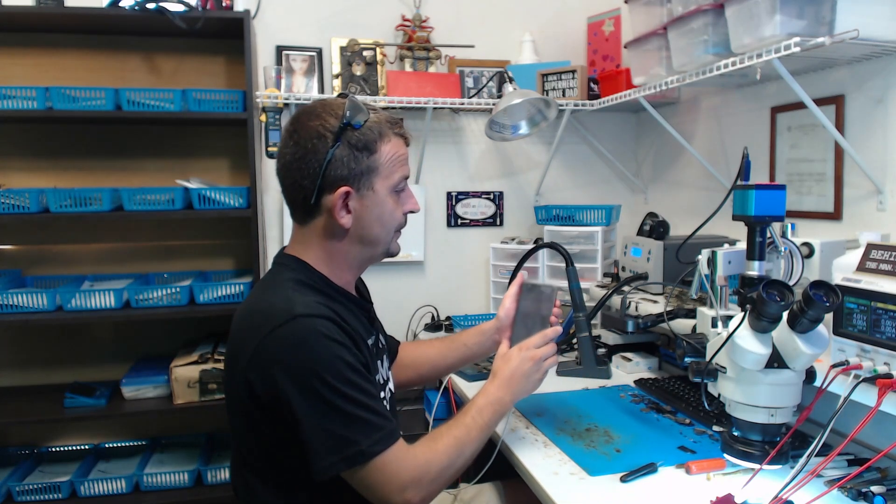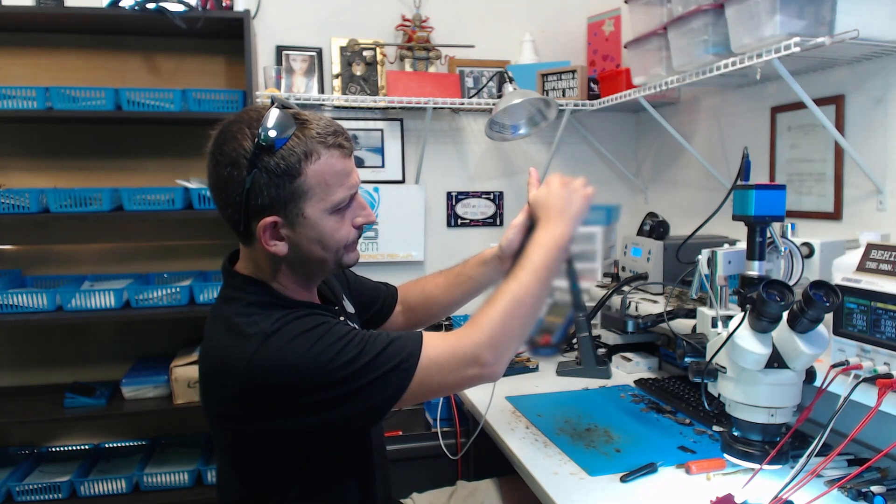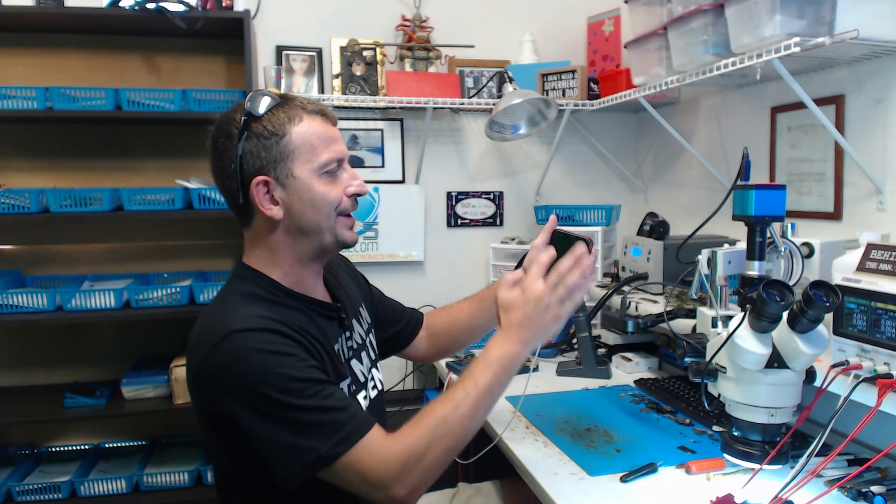That's the chip right there. Since this little chip was bad it made everyone think it had no image, but as you can see we have this phone back up and running with working image. It's a little dim right now because I don't have the front-facing flex cable connected. From here I'm going to get the shield put back on, clean the bottom end of the PCB — I'll solder the shield back on with an iron rather than hot air. That is going to be it for this one — another happy customer. Thank you for watching, I will see you in the next one.